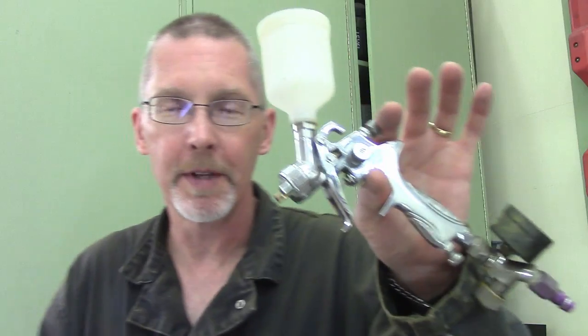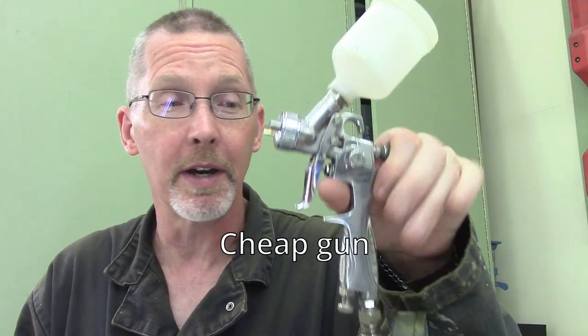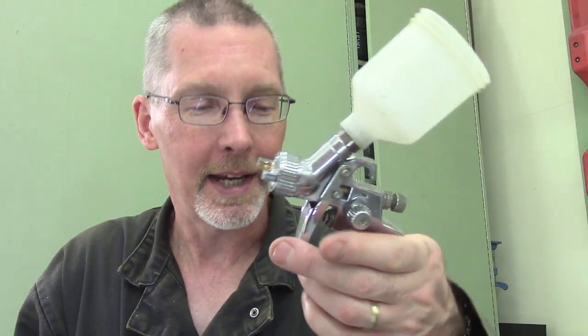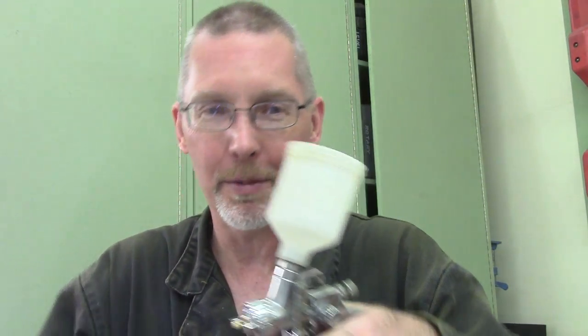This one is a DeVilbiss Finish Line gun — I think I paid about 300 bucks for it. It sprays really nice, I quite like it. It came with I think a 1.2, a 1.5, and a 1.8 tip, which allows you to spray pretty much everything you're going to be spraying. This is from Princess Auto — it comes with a 2.3 millimeter tip, it will spray a lot of material. It was green anodized — turned out it was just green lacquer which dissolved the first time I cleaned it, so now it's just bare aluminum. I think I paid 40 bucks on sale — sprays fine, good for primers and high build primers. This one's my favorite — it's just a touch-up gun from Princess Auto. A couple things: make sure the tips are done up really tight because it tends to lose its spray pattern pretty easily.